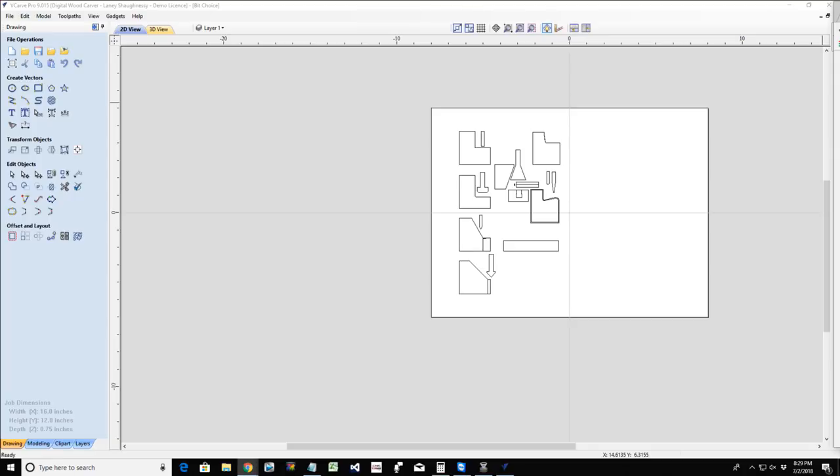Now, if you're talking about the step over for 3D engraving with the bits, that step over is going to be determined by the angle of the cutter. If you're using an 1/8-inch end mill with a 7-degree angle or an 1/8-inch end mill with a 5.4-degree angle, it's going to be based on the cutter when it's calculating that tool path. That's why I say it's very important to have the appropriate tool in the tool path when you're calculating it. Because if you're using a different tool, you're going to get the wrong cut, because it's calculating it based on the tool diameter and angle of the cutter, the tool, and everything. So the step over is determined by the tool path and the bit being used.